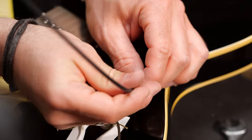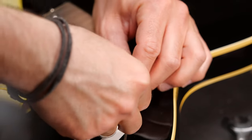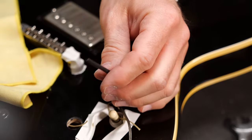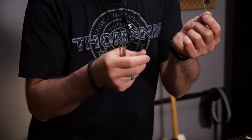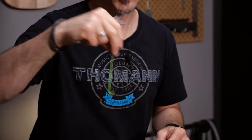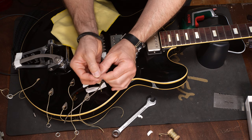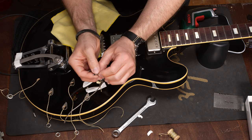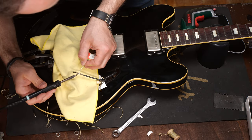If you want to make sure there's no unwanted ground connection, put a shrink tube around the bridge. You can also use a braided pickup wire. You will definitely need tweezers. You can also bend a paper clip to have a hook at the end — with that you can grab things through the F hole. Shorten the pickup wires if necessary and solder them on the pot the same way the original pickup was wired.